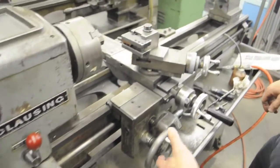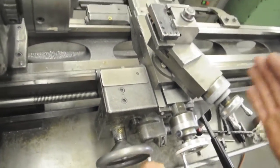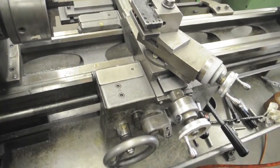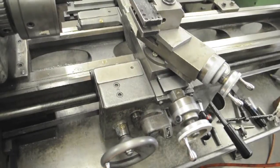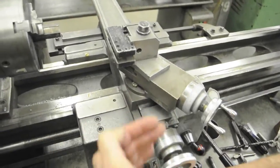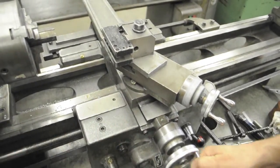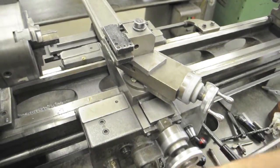On the carriage, this biggest hand wheel rotates and moves the carriage left and right. The direction that the top surface of the wheel is going will tell you the direction the carriage goes if you forget. This is the cross slide — crossways to the way, or sometimes crossways to the longitudinal feed. It can only go perpendicular to the spindle; that's the only direction it can move.